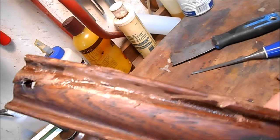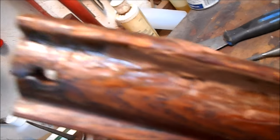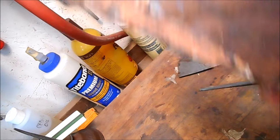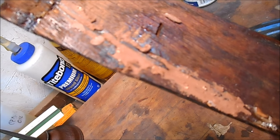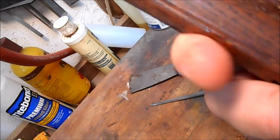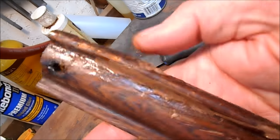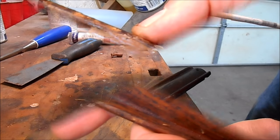Okay. That's the first coat of epoxy putty to fill in the cracks and start to work the shape back. We'll let that set up, and then I'll hand sand that, get it smooth. Here's the back, those cracks out of there. So between the CA glue and the epoxy, I think we've got it. Certainly structurally, it's rock solid, and we'll get the appearance nailed down with some sandpaper, and then down the road a little bit of color.